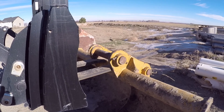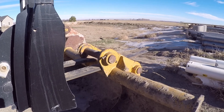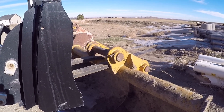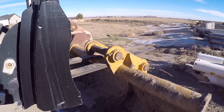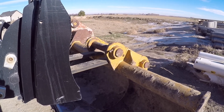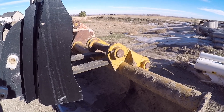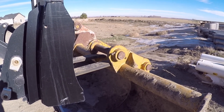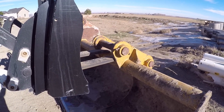So I'll fire this up and we'll see if this will lift it or not. I do have about 950 pounds of ballast in the tires, and then I've got my box scraper on which weighs about 850 pounds. So I've got about 1,800 pounds of extra ballast on the rear of the tractor — so this thing should lift it if it's working properly.